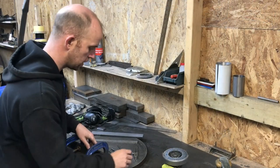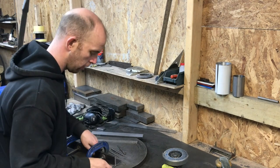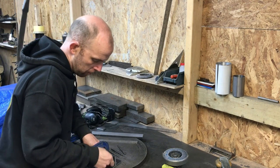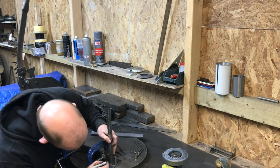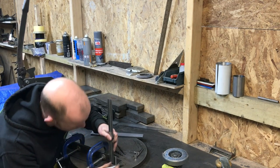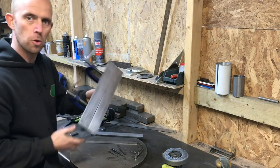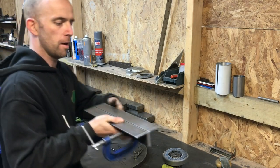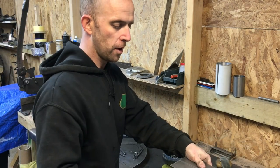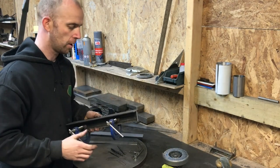My next stage is to drill and tap the hole in this plate here. I'm just going to come up there, mark halfway, and I'm going to tap that M8. What this is going to do is just keep the two plates aligned, so I want that surface to be completely flat when I put it into the vise — this way it's consistently the same every time.